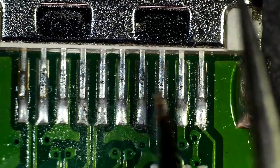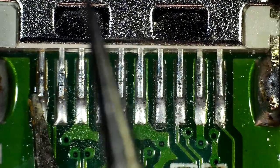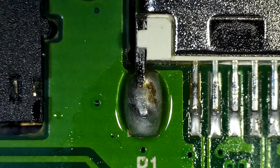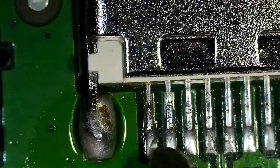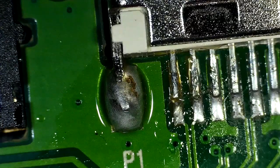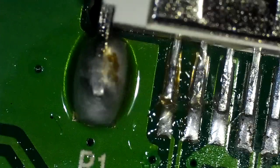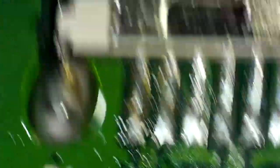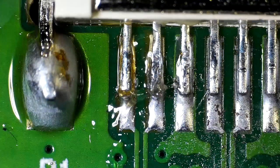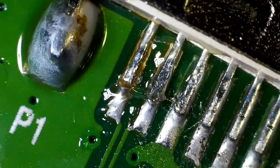At this point we're just poking the pins to see if they're moving after soldering. We just saw two at the end moved — that's not good. They're both connected too. The other VGA pin that was moving I think was not connected, but these two are clearly signal lines, so I definitely want these to be connected. Maybe that's why it wasn't working. I stopped using this thing because I was afraid that if I wiggled it any more in use, I'd rip pads off or something. So I figured I'd just have to do maintenance on this anyway, even if it's still working.